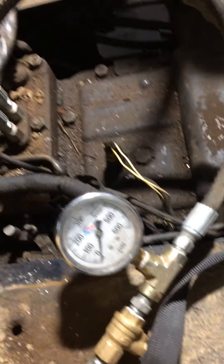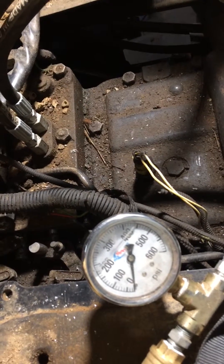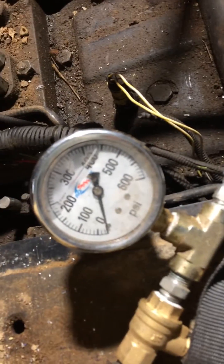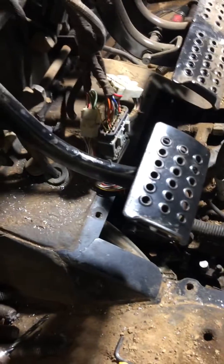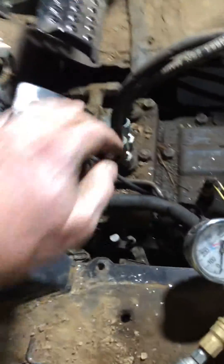When I had my gauges hooked up and put it all back together with new plates and new hubs, everything else looked great in the transmission. You're supposed to have 218 to 260 pounds of pressure on this circuit. I had my pressure checked out well, but while driving it to put some diesel in it, I noticed my pressure was down about 150. I put my foot on the back of the pedal and pulled it back up, and the pressure returned to normal. This pedal originally had this spring on it that pulls it back to home - when it was staying down, that's what was causing it, and that acts as a relief valve.